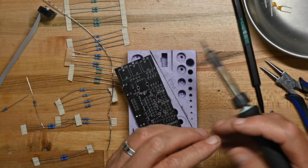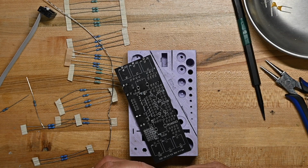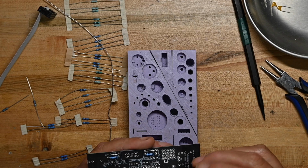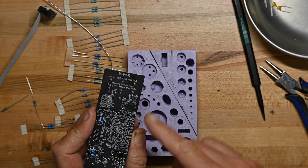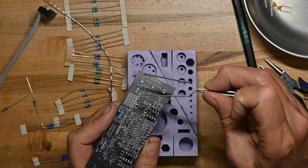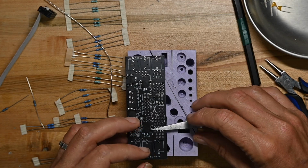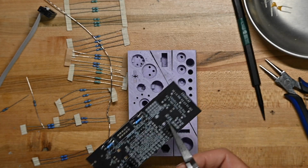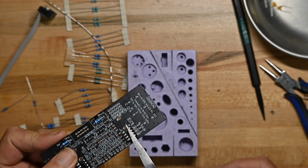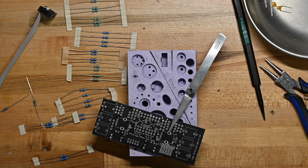The other thing you can do, and I generally do this for larger IC sockets, 24, 48 pins, whatever, is, oh, by the way, this notch is on this side, this notch is on the outside, so just be aware of that. So take your socket, put it on the board, get a pair of locking tweezers, which I strongly recommend you have. I have a video about tweezers that I'll link to in the description. And now that the tweezers are holding the socket in place, it's not going anywhere. You can waggle it around, you can do whatever you need to do. And again, I'm going to do the same thing. I'm going to solder one leg.